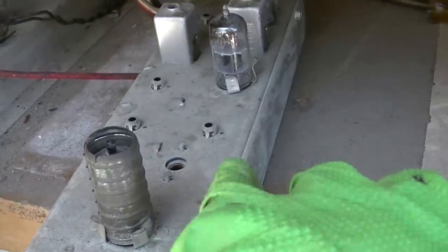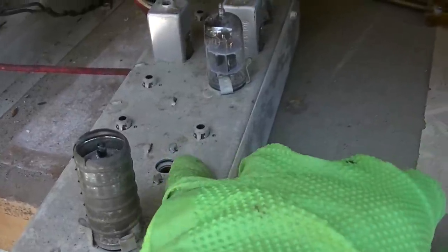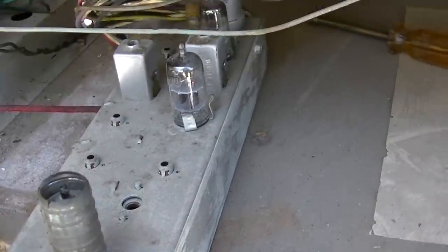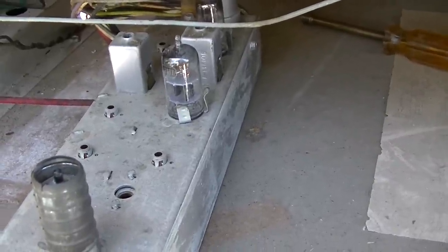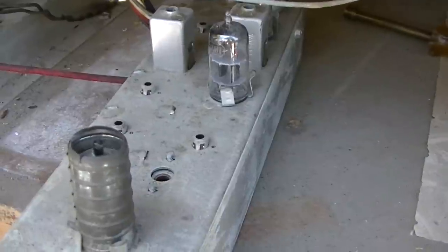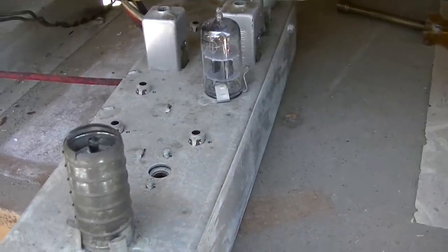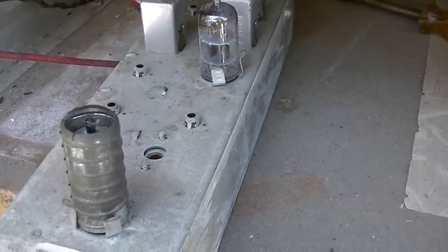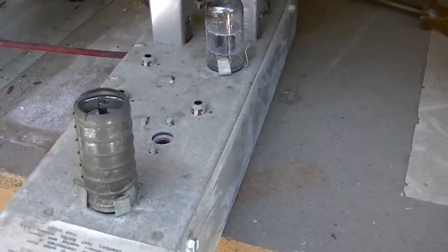Yeah, it makes sense. That 4 microfarad capacitor was opening, not passing the bass audio through, not without the separation. So, let me see. I might dig the stereo generator out. I don't know if this is worth trying to tweak on or not. What's kind of cool is you can turn that down, but it needs that in order to separate the left minus right, or left plus right, or however it works, I forget.